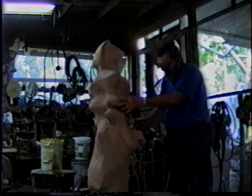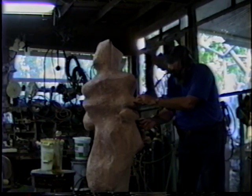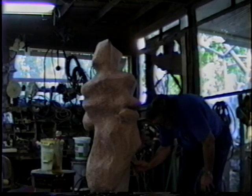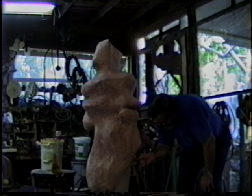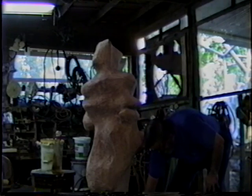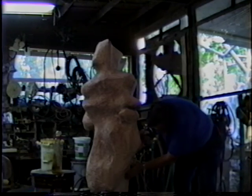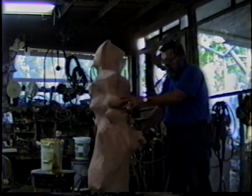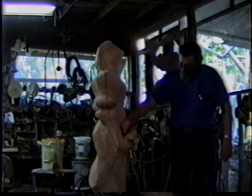Now right here, this is going to be tricky. Otherwise, it's a fairly simple form. So we'll go ahead and do the big form. See, we'll probably have to come over to here. Then come down there so we won't have a big undercut. And then come back. There. So when the copper gets around to here, starts around, well then we screw that. This probably will have to be made as a separate sub-assembly and then welded on afterward.